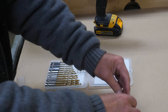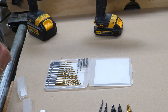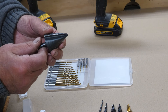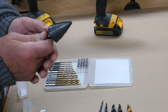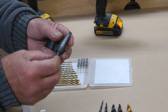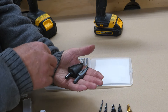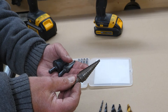I'm going to compare these — that one's titanium coated, these are just high speed steel — to some very high-end ones. This one here happens to be a Greenlee, and it does not have a split point; it's just a 118-degree point, so you really have to center punch something. This is also very expensive. Here's another Greenlee — again, 118-degree point. And here's a very old Klein one I used to carry in my tool bag when I was working.